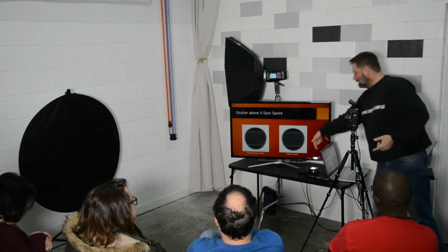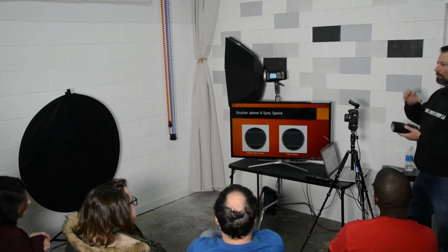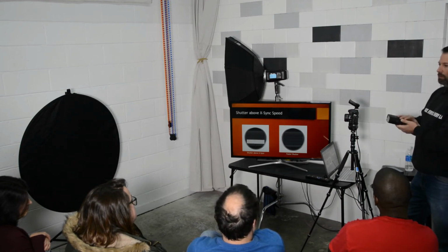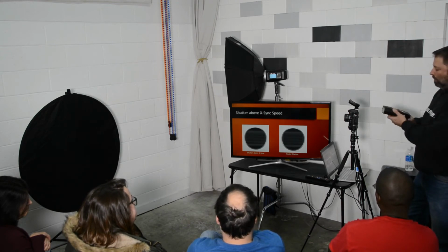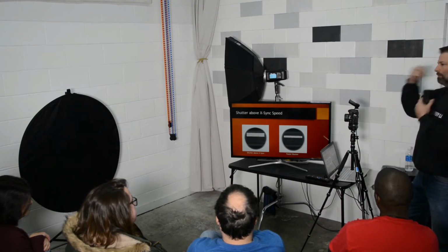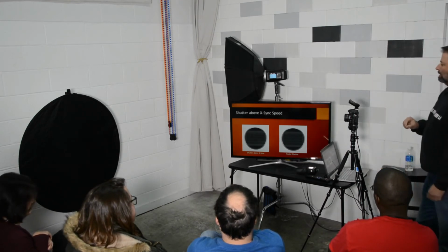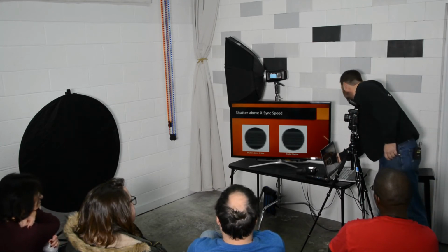These xenon tubes and these other technologies that fire these, you've got capacitors that build up a huge electric charge, high voltage, not a lot of current, but huge amounts of voltage. When the voltage reaches a peak, that's when your little indicator says, okay, you're ready to go. You hear the little whining noise, and it dumps all that power across a xenon tube, and a lot of that electricity is turned into light. You get that very, very fast pulse. But it lasts for a very, very short amount of time. So, let me go back. Let me show the demo of this if I can.